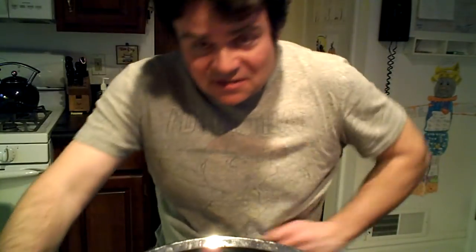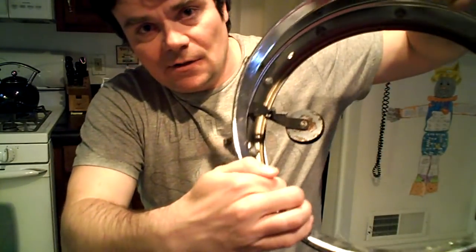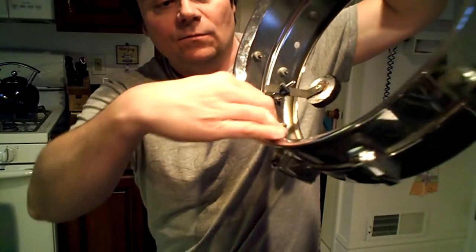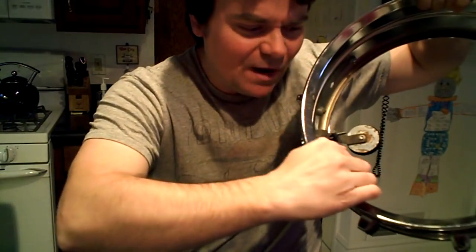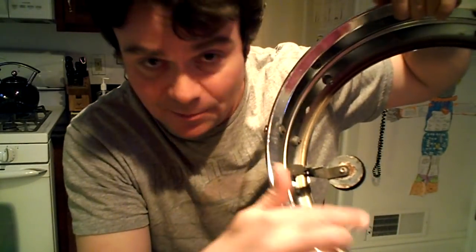Years ago I went to a place in Chicago called Griffin Plating, down near Clybourne and Elston and Armitage. I went in with two shells — a 6.5 and a 5x14, pitted to heck. I said, can you remove the chrome and polish them up? One older fellow there saw me come in and said, don't tell me, I know what those are. He was missing part of his finger — he'd been buffing one of these and it flew out of his hand. On spun shells, the edge is relatively sharp; if it's spinning at high RPM it'll slice you up.